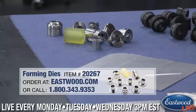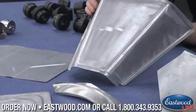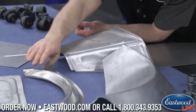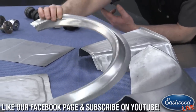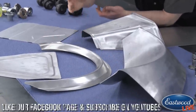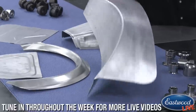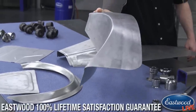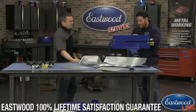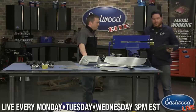What we've been showing you today are our forming dies — there are 10 of them including the one on this wheel, which we'll be showing you how to use. Beyond using a bead roller just for beads and floor pans, you can make things like a transmission tunnel, fender flares, arches, or even just a patch in a fender where a lot of stuff rusts out. These dies really expand the abilities of a simple bead roller.